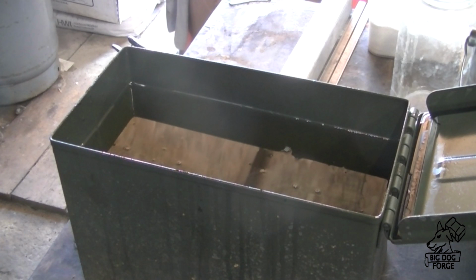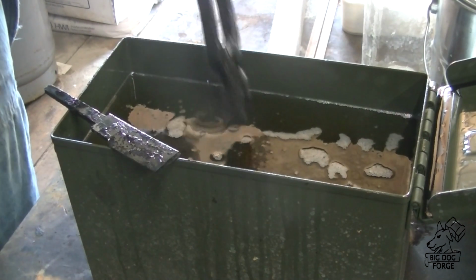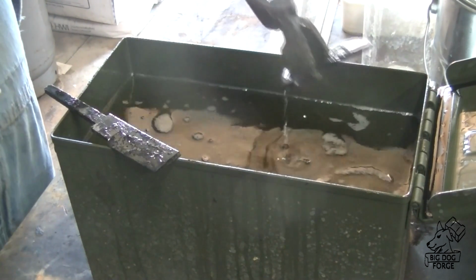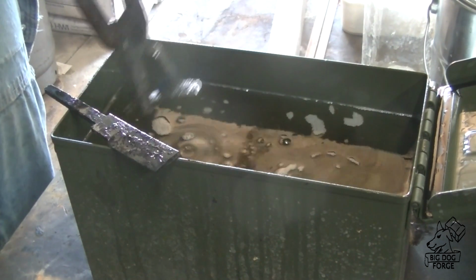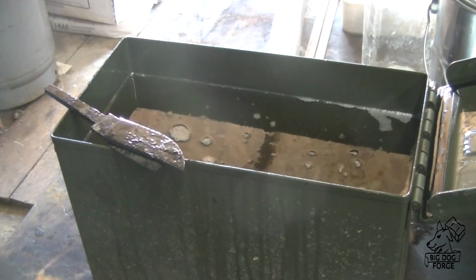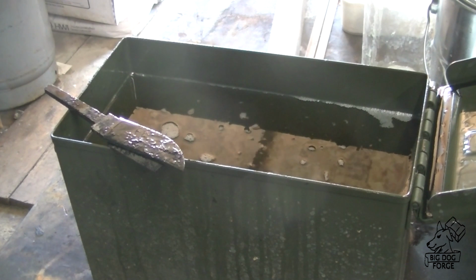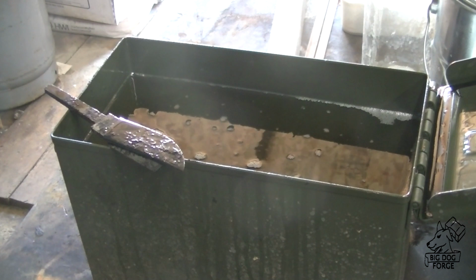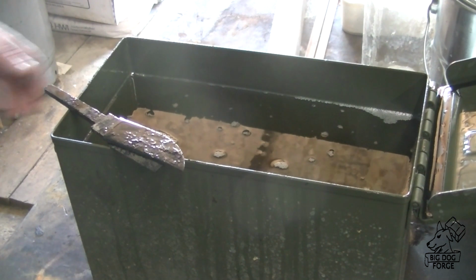I'd quenched the blade 5 times. The battery on the camera had gone dead. For those of you with a weak constitution, you may want to turn away. As I was dredging through the oil, attempting to recover the other half of the broken body, I realized that quench after quench had built up a massive amount of stress, much like the stress in my mind, and the blade simply snapped. Man, that's enough to drive you crazy. I don't know.